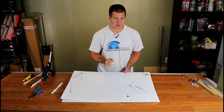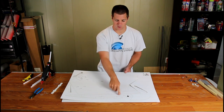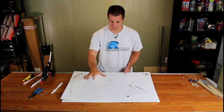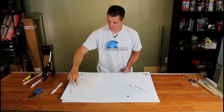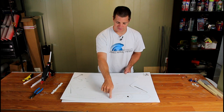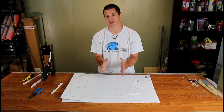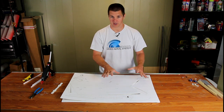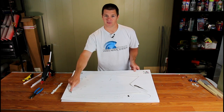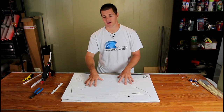There are some parts that don't have keyways, such as the stress beam, which goes along the keyway section to give extra support to the airplane. There are also notches for a keyway part that joins the plane halves in the middle. These are made as a sandwich with other parts that aren't cut with notches, and this is repeated on the other panel as well.